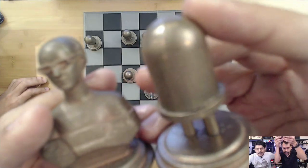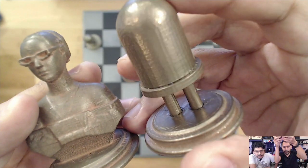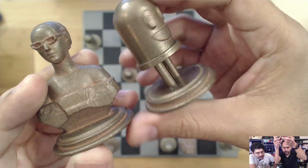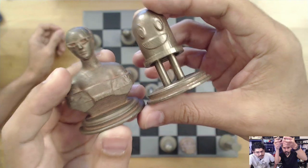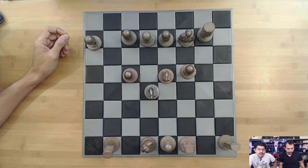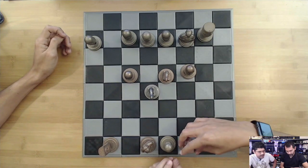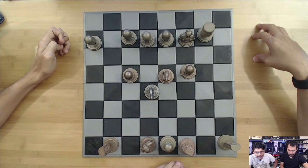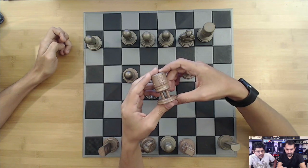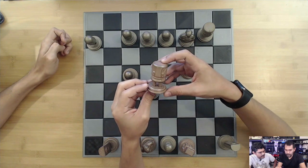The reflectivity is really nice — you can almost see reflections in this. Back to the 3D printing community on Google Plus, a lot of people were interested. Somebody made a great comment saying the steel has little sharp edges, which makes it really good at abrasion. When you look at commercial tumbling media like what you'd use on rocks and gems, that resin-bound abrasive isn't as good. Steel nails and washers are actually a very cost-effective and uniform tumbling medium.